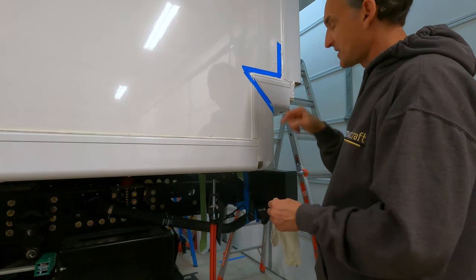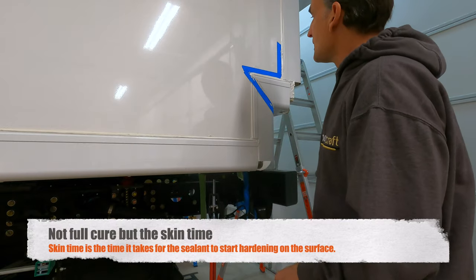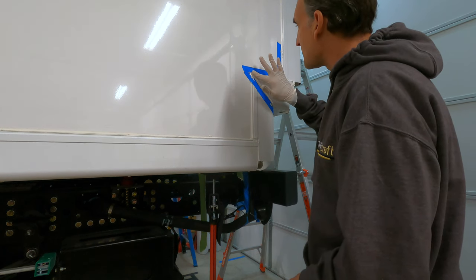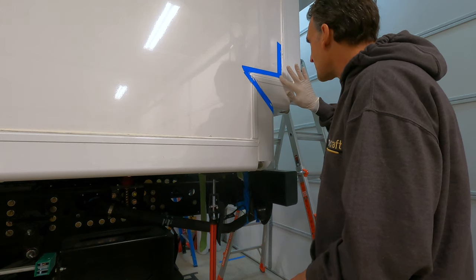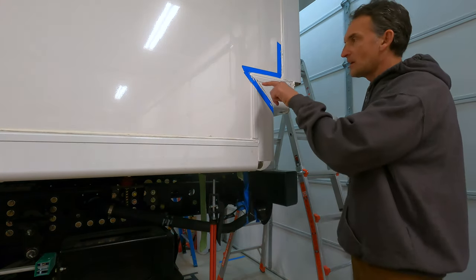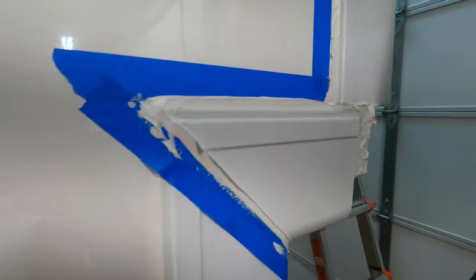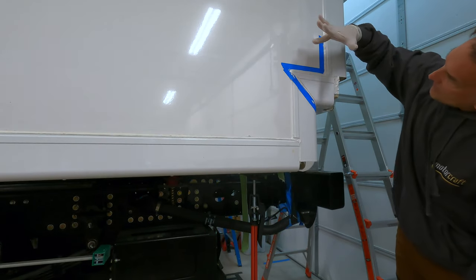A few tips on caulking up these seams: mask them on both sides. Pull off the masking tape within about 15 minutes, which is roughly the cure time. Try to apply as little caulk as possible to avoid overlap. Sometimes when pulling out the tape there's a little wall of caulk left behind — you can come back and smooth that out. In these corners you can always push it in, and here anyway it's going to be covered by the cap.